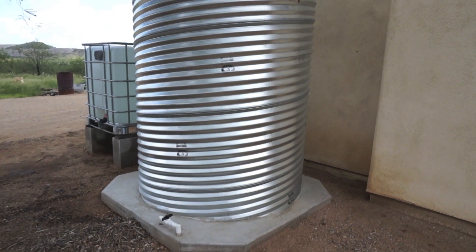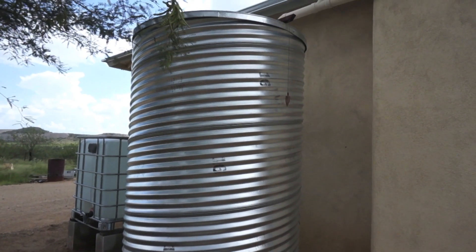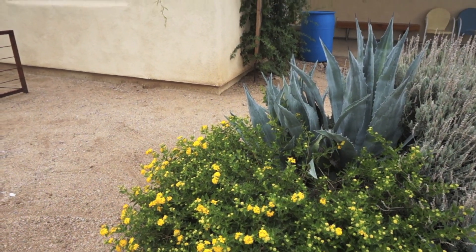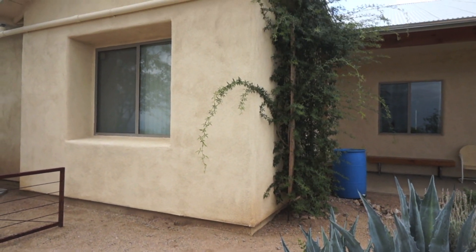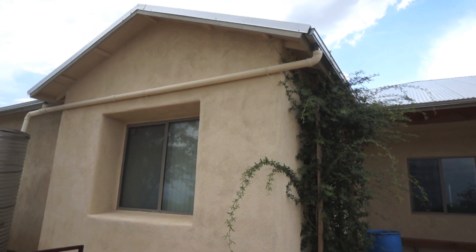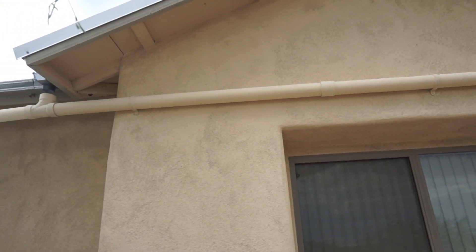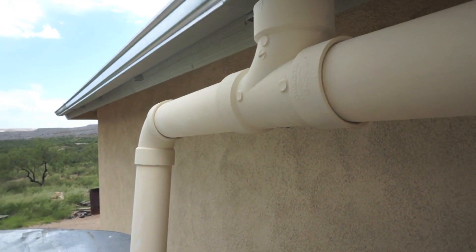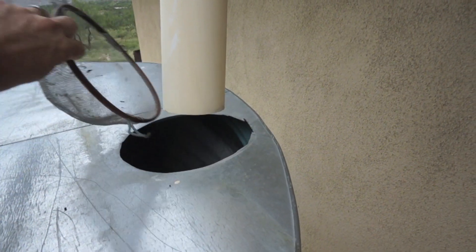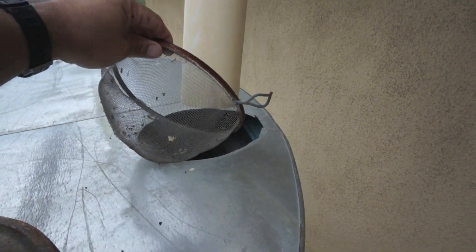This cistern is comprised of an eight-foot by five-foot diameter culvert. It holds about eleven hundred gallons, and I thought it was a good size because it could fit in a truck and be handled by just a couple of guys. The water that fills this cistern comes from two separate sections of gutter on either side of my garage. They run through a three-inch PVC pipe over my garage window and into the cistern. To screen out bugs, leaves, and other debris, I've used a rather technical feature — an old kitchen strainer. It's kind of rusty and not of great quality, but it's been working well ever since we installed the cistern and I see no reason to change it.